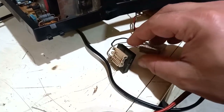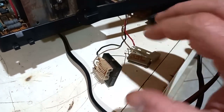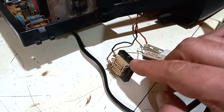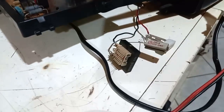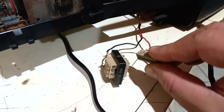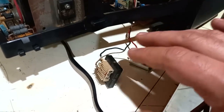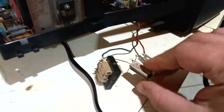The second mod is this component here: a 40 millihenry inductor with about 5–10 ohms of resistance in series, to reproduce the characteristics of the vertical deflection coil. I suggest using a closed-core inductor because the magnetic field of an open-core inductor can mess with the picture tube and make the dot vibrate. This is fairly needed, especially in late-style TVs, because the circuit will notice if the coil is disconnected and shut down completely. You need to provide a dummy load. You can also hook up another deflection coil from another TV, and this applies to the horizontal deflection coil as well.